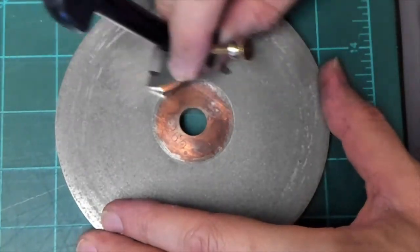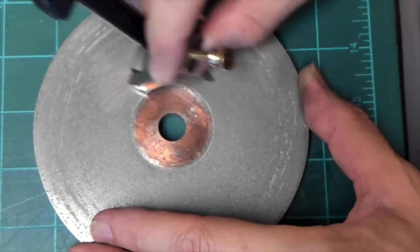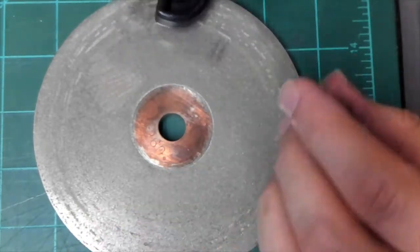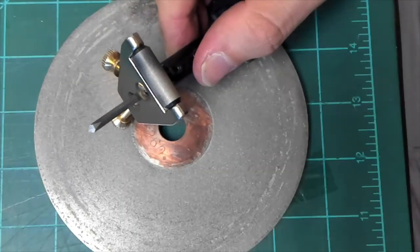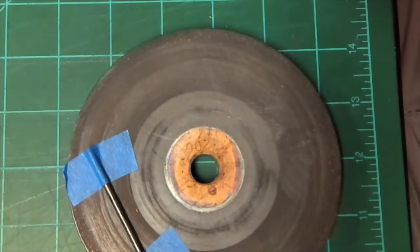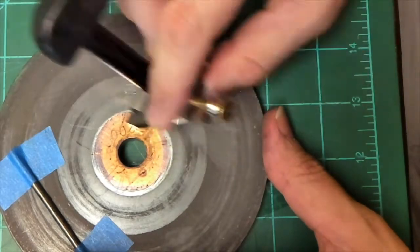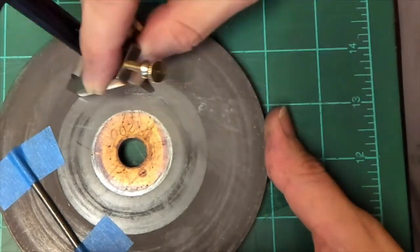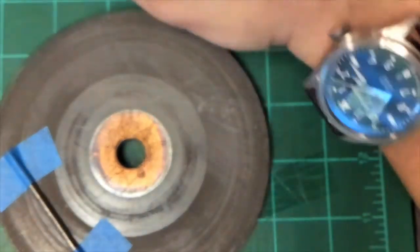We will start with a 260 wheel. Grind back and forth and move in different directions. If your tool was dull before, this would be a good time to test whether or not it is sharp. If it is sharp, move on to the 1200 wheel. Do the same thing, back and forth in different directions. In this video, you see that I'm using a 1200 grit wheel. A 600 grit wheel will be fine as well.